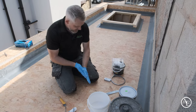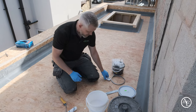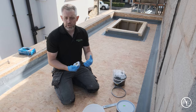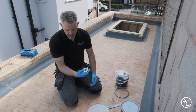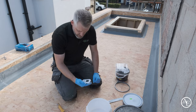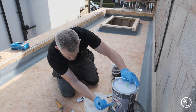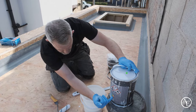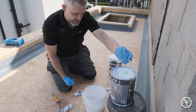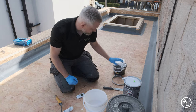Any time we do a mix, whether it's with the primer or the main 2020 resin, we need to take a temperature reading of the actual deck. Don't use your phone — your phone will give you the ambient temperature of the area. We're looking at 15.6 degrees on the deck. Check the back of the can: roughly a litre of mix at 15 degrees means three scoops. Consult your chart for your litreage, then put the associated scoops in.